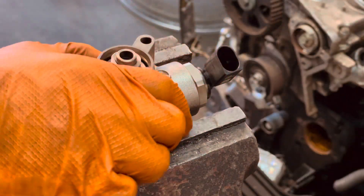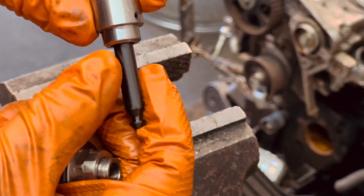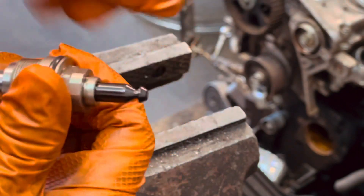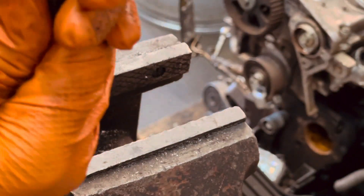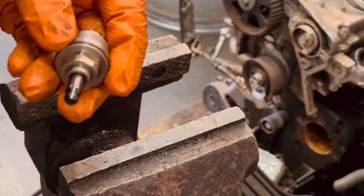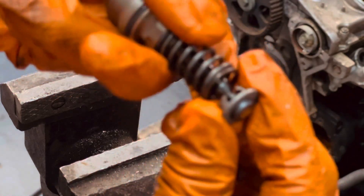Take this out of the vise, insert the piston with the wide end inside. It should be a pretty tight seal for the piston as well. Pull the piston to the top, make sure it's got good movement. This one's kind of sticky — get some oil in that. But it is airtight, which is also good. Then you're going to take your spring and seat this button down inside the cup so it holds it still.